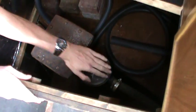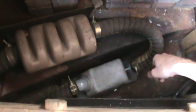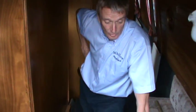This pipework runs through here, down behind the back of the stern, round the back, and then actually comes through to this system here, where you've got more filters and a pump which then takes it through to a heat exchange unit actually on top of the engine to cool the engine down.